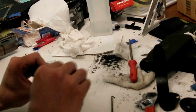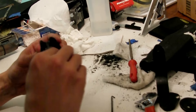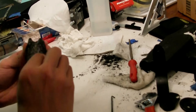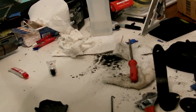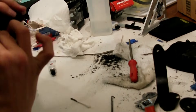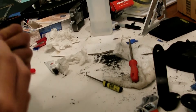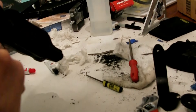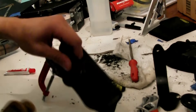JB weld is something I usually stay away from, but for kydex it's going to be stronger than the actual material, so it'll be fine. To ensure I have a really good bond between the two, I'm using a way larger amount of JB weld than I have to. I'm also clamping the two together with a lot of force to make sure I don't have any air pockets between the pieces. Because I'm using a clamp and an excess amount of JB weld, a lot of it's going to be pressed out, so I have to clean it up as I'm squeezing the two together.